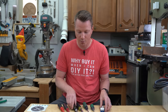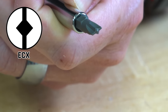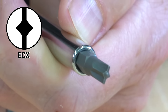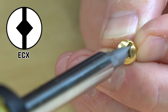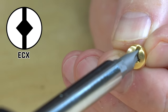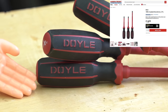I recently ordered a 15-in-1 screwdriver from Klein that comes with ECX bits. The ECX is a combination of a Robertson drive and a slotted screwdriver head — it takes up all of the negative space inside your screw head and is perfectly designed for electrical screws. It is the optimal driver for outlets, switches, and similar work. Most of these are available on Amazon, some only at Harbor Freight, Lowe's, or Home Depot. Even better, get the insulated version — it's the best of all worlds.